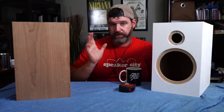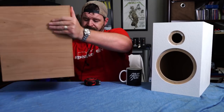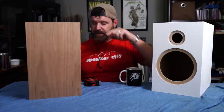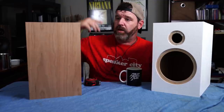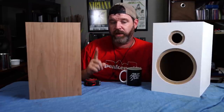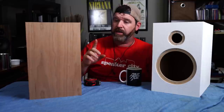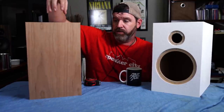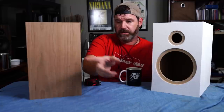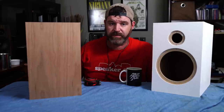What I wanted to do is run the grain up and then over and then down — kind of continue the grain. The thing about it is I wanted the front panel to cover up all of it. So I do flush routing after I put the veneer on each panel, then I flush route it. In order to get the front panel to flush over all the others — because there's a tiny little overlap — you have to cut the front panel and then not put it on. So you cut it, leave it off, then start on the top, go down the side, go underneath.